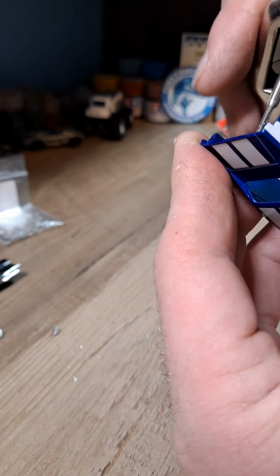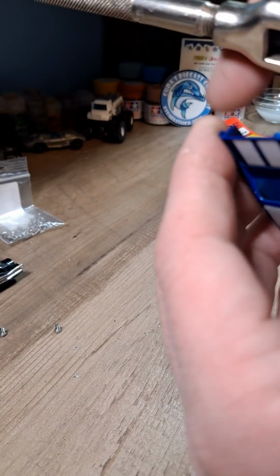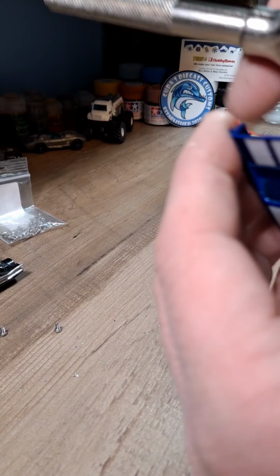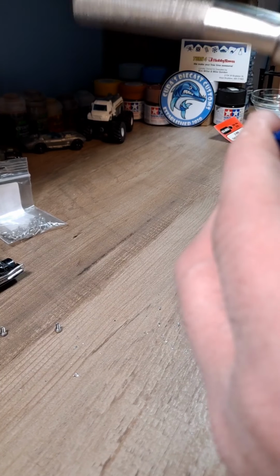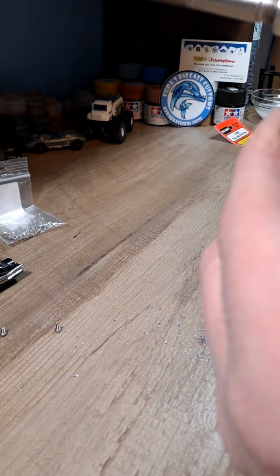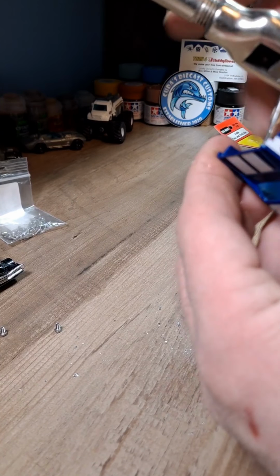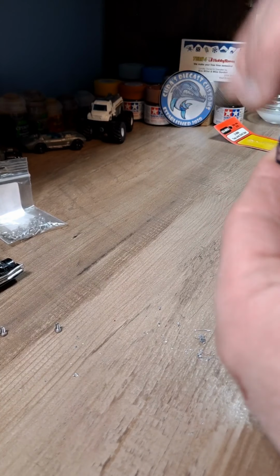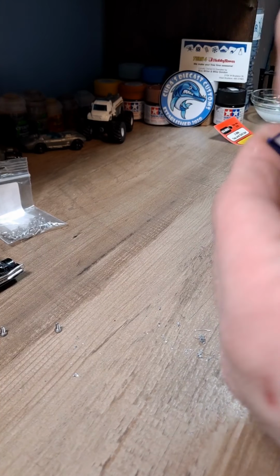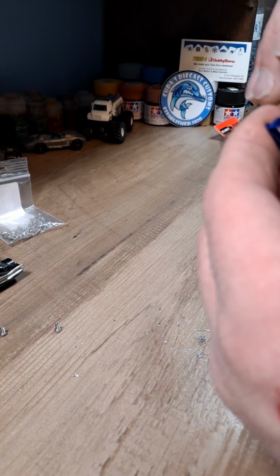You'll feel it start to cut the threads. What you do, back it off. Once you get it in there, then you can move a little bit more aggressively. But you gotta make sure you get the threads started straight in that hole. Now granted, it's only gonna be as straight as you drill that hole. If you drilled your hole crooked, well, I see that one didn't seem to be as deep. So hopefully I drilled that one enough. It's already bottomed out on me.